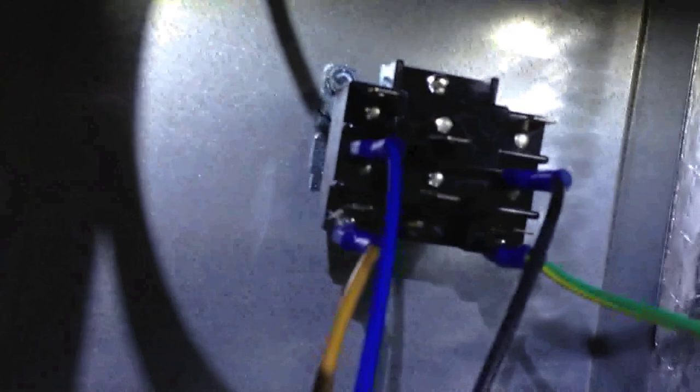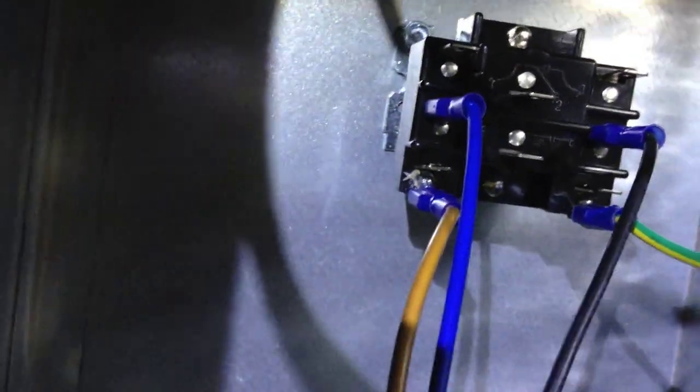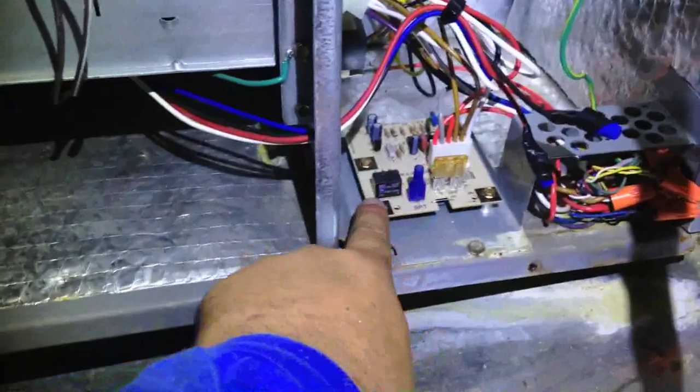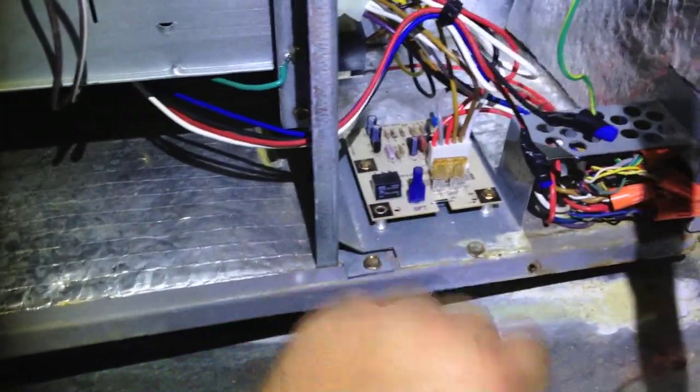We're running it on medium speed. There's our relay back here — I got the power going in on six, the black wire coming out on four. That'll stop this leg right here from being hot so nobody can get zapped. Using this green wire for my 24 volts and that brown wire as our common. I was actually able to utilize the plug from the original motor for power, which made things a little easier. There's our relay, capacitor, and new motor. I did cap off this tap here because the board is still good and was still supplying 24 volts through this leg, so I just capped it off.